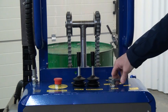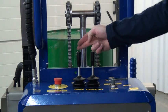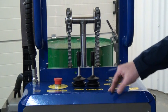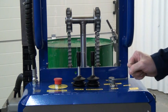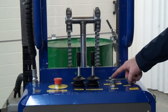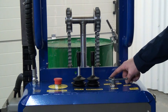To operate, the air switch must be in the on position. We have the lift control: pull back to lift, push forward to lower. To tip, push forward; to return, pull back. Letting go will stop all functions. The last control is the hydraulic pump reset button, which resets the pump if it ever stalls. If you repeatedly have to press this, it's a good indication that the pump needs a service.